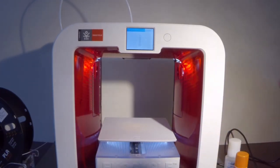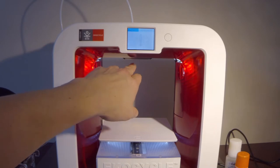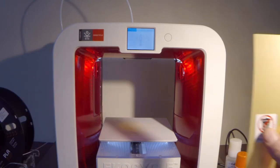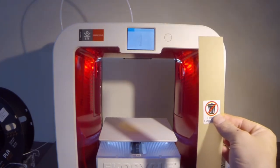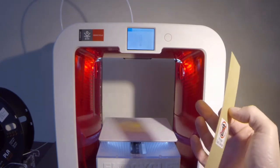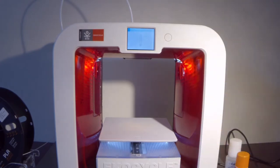They're a valued commodity. So this one's nice and clean. You probably can't see it. There's nothing to clean off of here. So I'm going to let this cool. Once the print tip is clean, I've got a gauge ready. If you don't have this, a piece of printer paper works fine. Just cut a little strip off. You'll find they both measure at 0.1 millimeters.